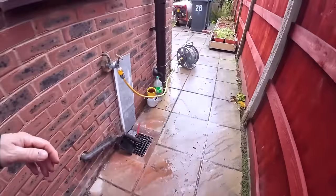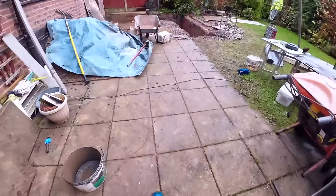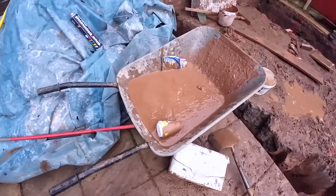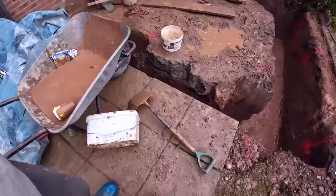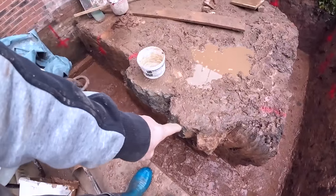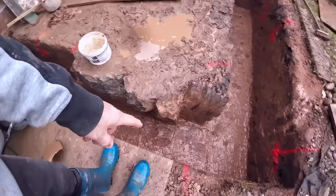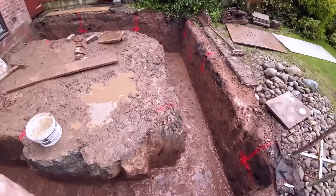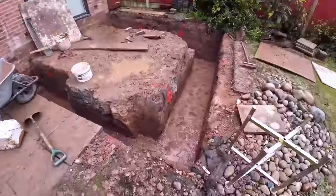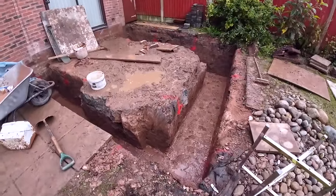I hate just standing and watching because I can't do anything. So here we go. It's all dirty again, obviously. There's another barrow slot we've taken out, and we've taken that bit wider, to underpin the concrete. As you can see, all dry patches of clay now. You've got a tiny bit of residual mush, but as you brush it, you're walking it back in, so that is definitely ready for concrete.